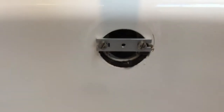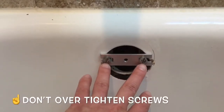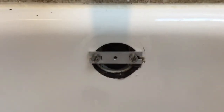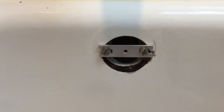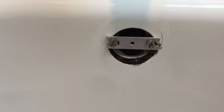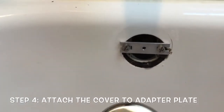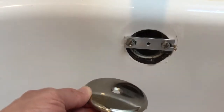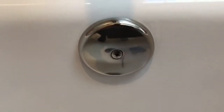I've got the adapter piece up, and one thing you want to be careful of when you screw your old screws in is to make them tight but don't go overboard. I'm trying to wiggle this and it's not moving at all — something tight like that is perfectly fine. You just don't want to over-tighten and hurt the bathtub. Once that's set up, get the new screw that came with the new overflow plate. Put your new plate up — the cutouts go on the bottom because that's how the water gets into the overflow pipe — and tighten it up.